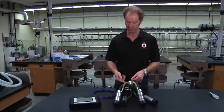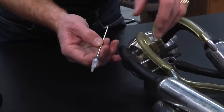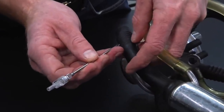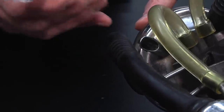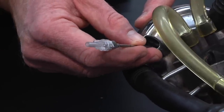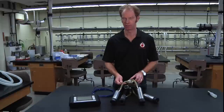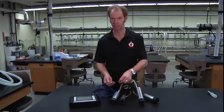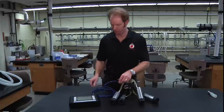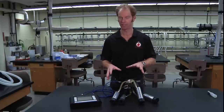To set up, take the short milk tube and remove it off the nib attached to the top of the bowl. Take your hypodermic needle and introduce it at an angle toward the end of the short milk tube, threading it down through the inside of the rubber, down through the nib, with the end of the needle ending up just inside the top of the bowl. The end of the needle should sit within the vacuum but not in the milk flow itself. Attach the hub of the needle to your sensing tube, which then attaches into the vacuum recorder. With this set up prior to the cows entering the parlour, you're ready to take average claw vacuum as the cow is being milked.